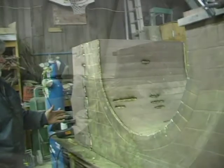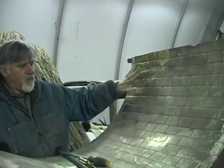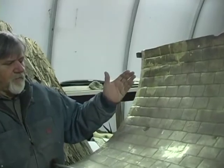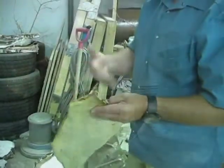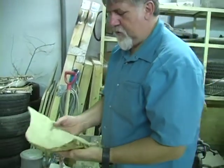We had to design a machine that allowed us to take these plates, which were essentially poured flat, and then in order to curve them, we had to make a machine pattern where we could actually bend them to the shape that we wanted. Rubber allows flexibility to get in and out of crevices and also to do more than one piece. And the mother mold helps keep the shape, the original shape.